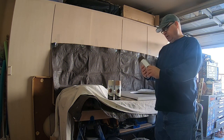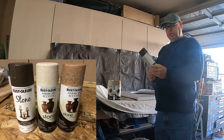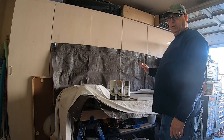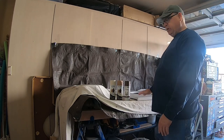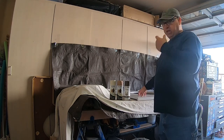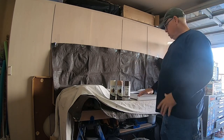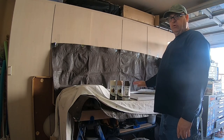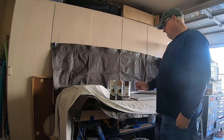Now we're at the step where we do our paint technique. I got these Rust-Oleum texture paints at Home Depot. I'm going to shoot them on here but leave it kind of sparse because I want it to be speckled so it looks more like granite. I don't want to cover the complete surface — I want to create some speckles and variation in colors. Once we do that, I'll let it dry and then do my float coat of epoxy over top, and that's what's going to bring the color out and make it look kind of like granite — glossy and really clear looking.